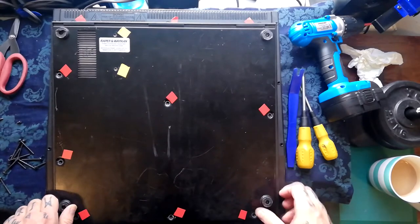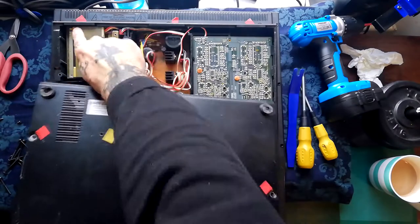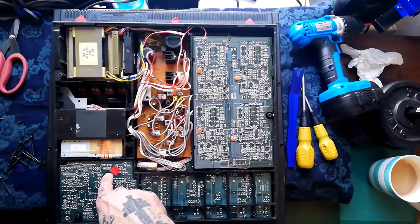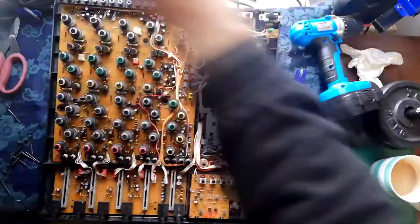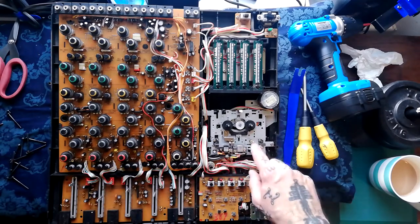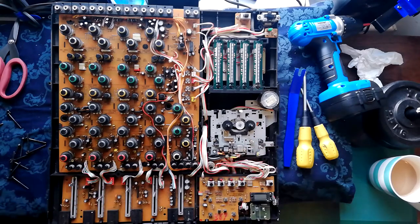They go here and here where the yellow tape is. With those exterior ones removed, get your fingers underneath. This metal plate ticks forward at the front, and you can see this lip here fits into plastic slots along this edge. When you open that you'd still need to remove one more of these longer screws from this post marked with red tape. With that removed, the front plastic case will come away. One dead giveaway of a problem here is that the pinch roller arm will just drop down — I don't think that's correct behaviour; there should be a spring there.